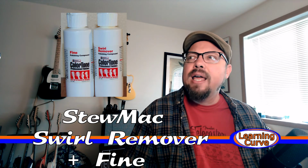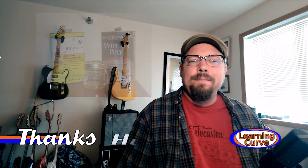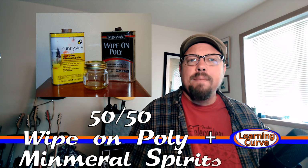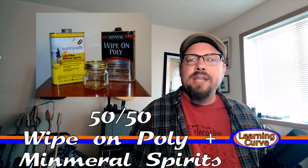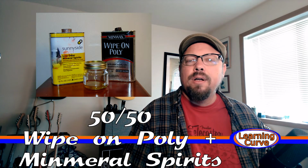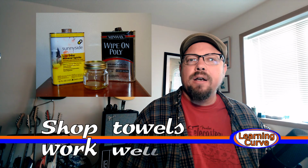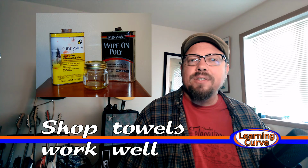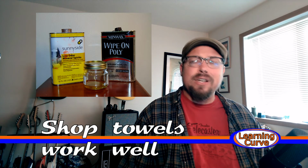And once I got those done, there was still a little bit of soapiness to it that I wasn't crazy about. So what I decided to do was once again go back to my Highline videos, and they recommend using a combination of polyurethane and mineral spirits, and you mix them together at a 1-to-1 ratio. And then I just took a low fiber paper towel and wiped it on as thin as I could over the whole guitar, and it filled in all of those spots, and now I've got a pretty decent finish.